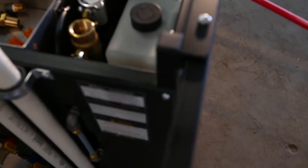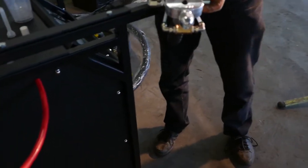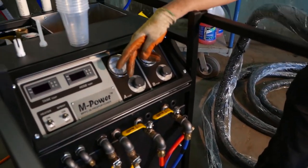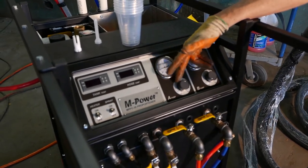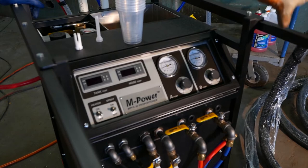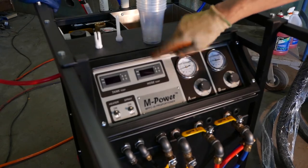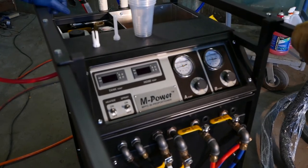When you're ready to spray and the system is up to temperature, you'll dial in motor speed on the panel, which controls flow rate. Viscosity and your skill as a sprayer can vary this considerably. Typically, start both A and B at approximately the same setting — around 3 — and let the system recirculate at full temperature for an additional 20 minutes before spraying.